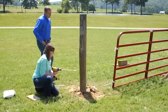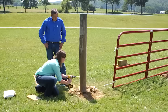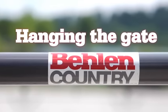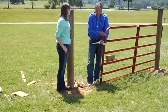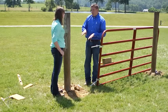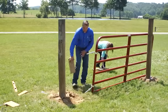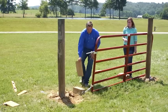Do the same on the bottom one. Now we want to put the nut on and a washer — you want to have this between the gate and the post, as this will give you your adjustment later on if you need to level the gate. Got the top one turned upside down again; the bottom one's ready to go. We're going to take some wooden blocks and prop the gate up to get the hinges lined up with the holes to make it easier to slide in.